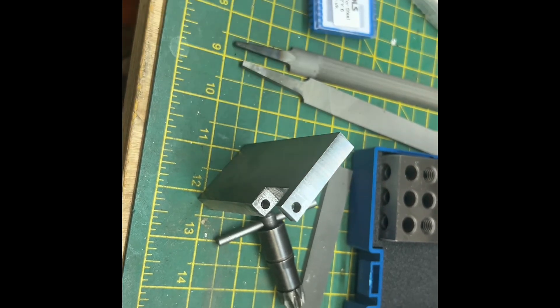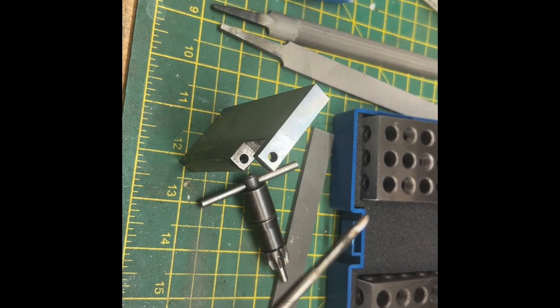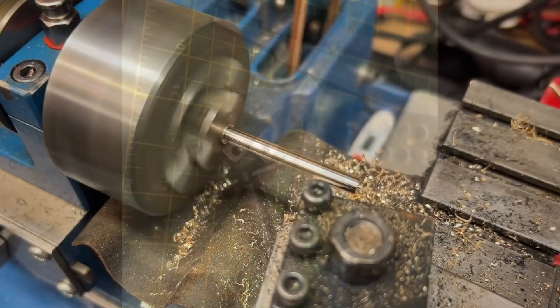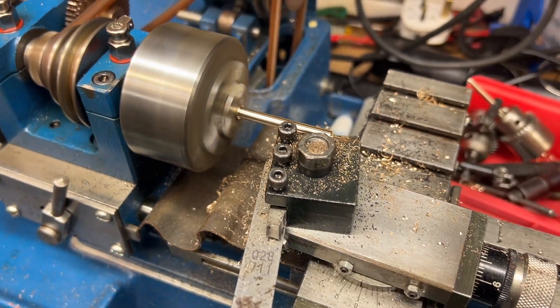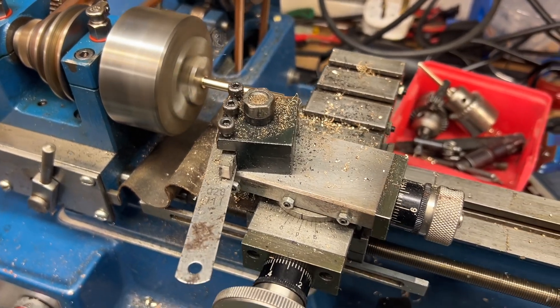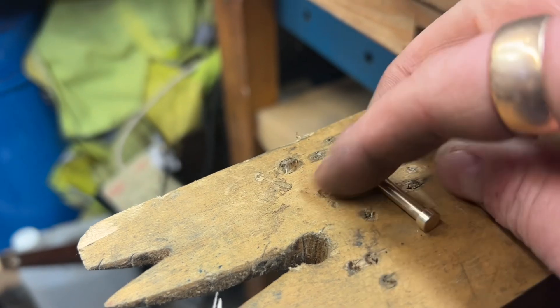You can see that the pin is tapped right down at the bottom just on one side, with a smooth pin in the center to create the hinge piece. Here I'm making the hinge pin out of a small piece of brass rod, which I've just turned down.